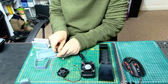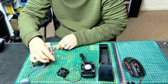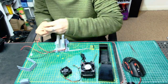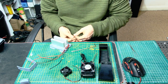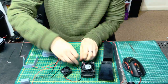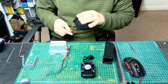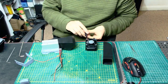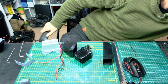That plate can then be bolted to the exosuit itself, thereby securing it to the overall mainframe. I purposely built in ducting holes for the cables to be managed and easily accessed, and we can very easily wire on small control circuit boards and things like that. These two nacelles will obviously be positioned in the armour, and there'll also be a separate pumping unit and environment control system nested in the armour between the two, allowing us to control fan speed and the overall temperature of the water being pumped around the torso.